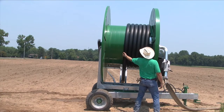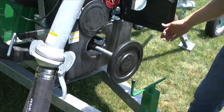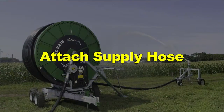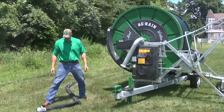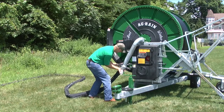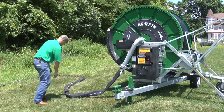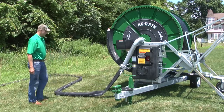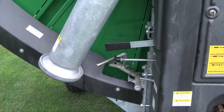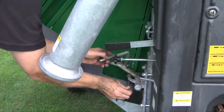Verify that the coils of tube remaining on the drum are both coiled and packed tightly. If they are not, use the hand crank and PTO input on the gearbox to tighten them. Attach the supply hose, being sure not to have any kinks or twists. If your supply lines have not been used for an extended period of time, flush them prior to attaching to your water reel. Lower the anti-reverse pawl prior to operation. The pawl should always be in the down position except during gun cart pull-out.